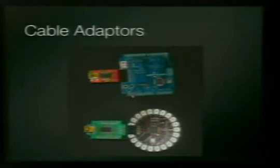These are the cables you need, and that's really a dark slide, but it's pretty much you need a USB printer cable with that A to B, and a mini USB or a serial or that FTDI cable up at the top. The FTDI cable's like $20, but it's got that chip in it. Or you can get cable adapters, like that little LilyPad at the bottom takes a mini USB, and you have to have that little adapter to convert it to FTDI, or you can get an FTDI adapter that takes a mini USB and plugs into the really bare bones board, or that one up there.